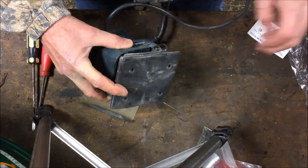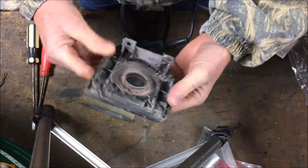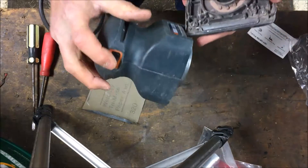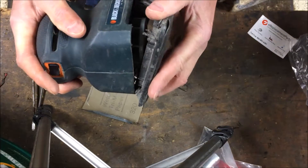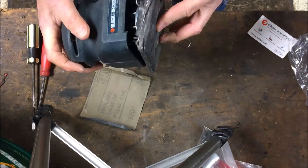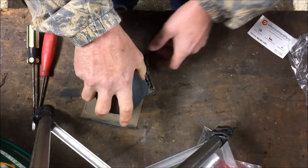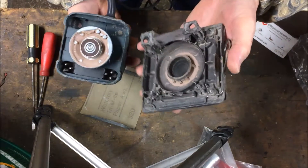Through wear and tear these edges wear down, get beveled, maybe get gouged depending on what kind of work you're doing. It's very easy to peel this off, clean it up, and put a new pad on. But when I came out today this one was in a little worse shape than I thought — this plastic piece here, which should be identical on the other side, is actually broken off. What happens a lot of times is if these things are turned on when they're not actually touching the object you're sanding, they will overrun or vibrate too much and something is liable to break. I like to put the sander on the item I'm going to sand, then turn it on, and before I lift it up I turn it back off. This is the kind of damage that can happen if you don't follow that advice.